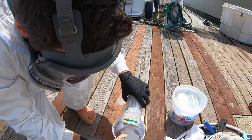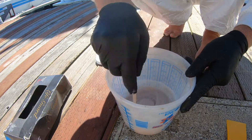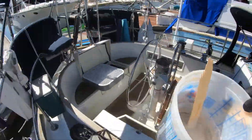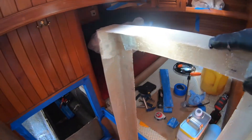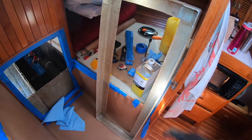As novice fiberglassers we were super stoked at the outcome, proving that with the right tools you can build anything with fiberglass. I have the 90-degree casing for the lid that we made and I mocked it up so it's in place and we can move in and out. Now I have to make a thickened resin, put it on the tank edge and on the casing edge, then set that down and clamp it. There's the tank edges cleaned up — this is the new frame that fits in there with just a little bit of wiggle room.